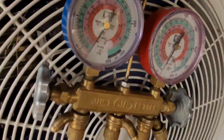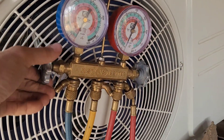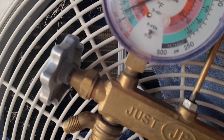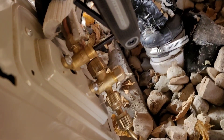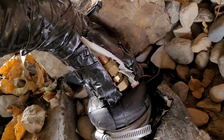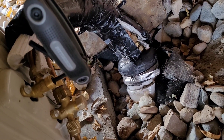It's been about five minutes, so we should be good on the vacuum — you can see it's holding nicely. Make sure that's closed off. We're going to go ahead and open this so our pressure comes up above zero. We'll go to 25 psi right there. I'm going to go and double check all the fittings. I have a digital leak detector — now there's actual refrigerant in the line, so I should be able to double check all these fittings. When I soaked them all down initially I didn't find any leaks, but I always like to do it twice just to make sure I'm for sure good.